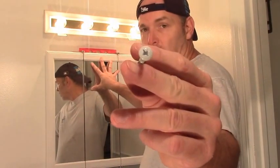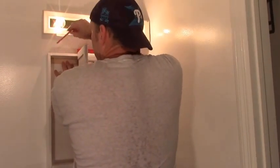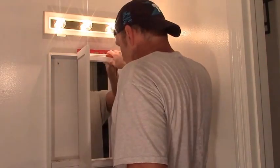I'm going to use these — it's called a cabinet screw. It has a white head on it so it'll blend in. If you were using a regular screw, this is a pan head screw so it's got a flat bottom. But if you were using a regular screw like a drywall screw — it's got what's called a bugle head bottom — you would need something called a cabinet washer. So I'm going to pre-drill a hole, get one up, and then level it up and move on. I know this is the high side and this side's going to go up, so I can put a screw in here just to hold it. Okay, I'm through.